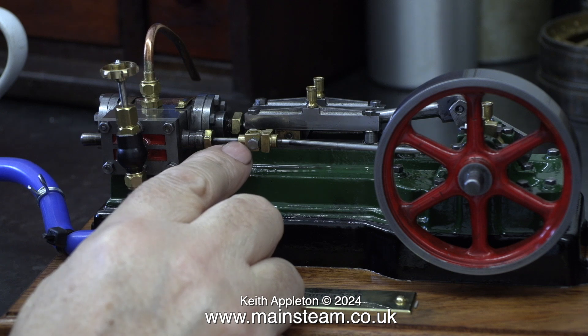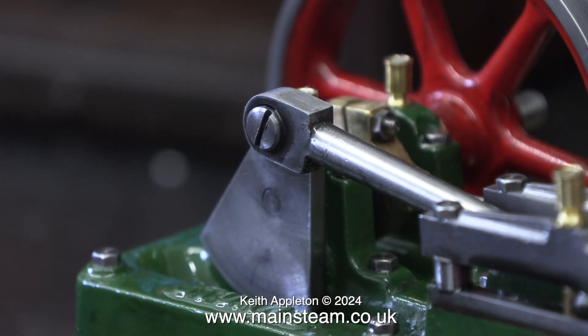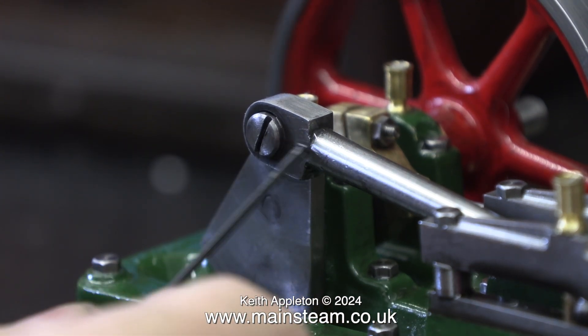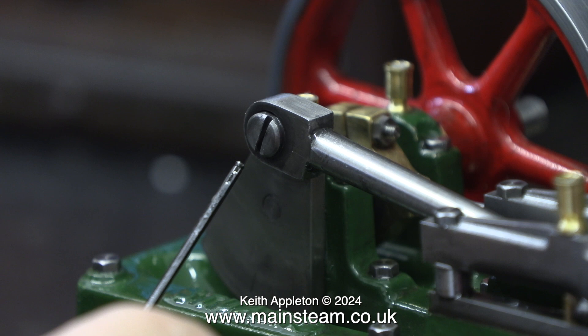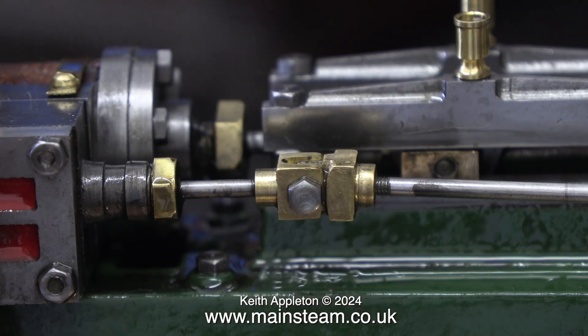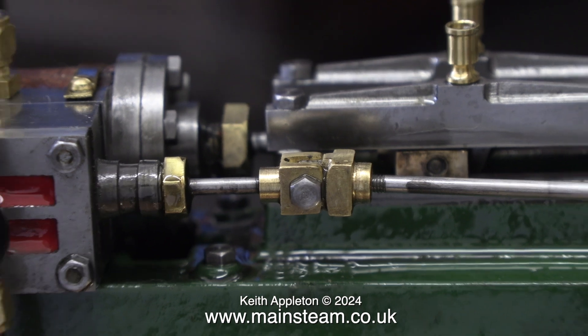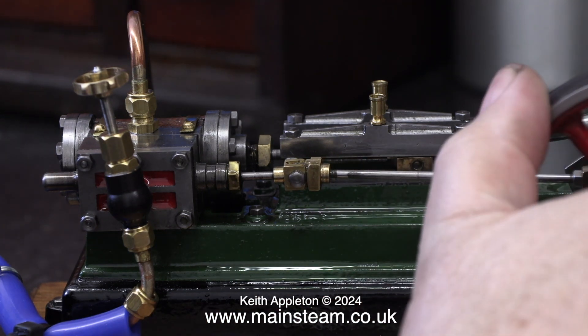Having a look at this, there's something fundamentally wrong with it. Generally speaking, valve forks have a flange at each side and not on the top. To illustrate this, if you look at the big end, there's a flange there and a flange there, but there isn't a flange at this side and there isn't one at the other side — because if you did it that way, it would be really big and bulky. This very delicate union for the valve fork would be great if it was flat on the top and flat on the bottom and only flanged at the sides. And the same with that — it doesn't want a big clumsy flange on the top. Again, it's the scale of things.